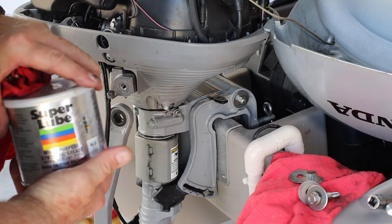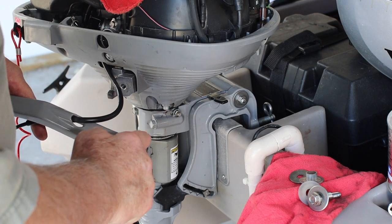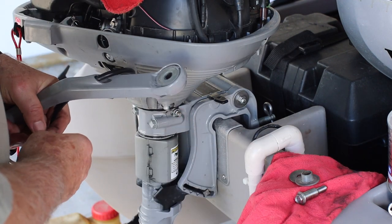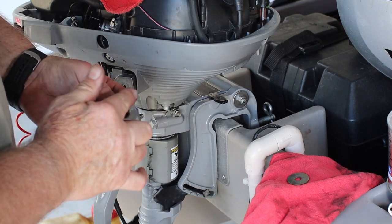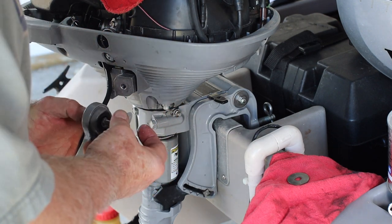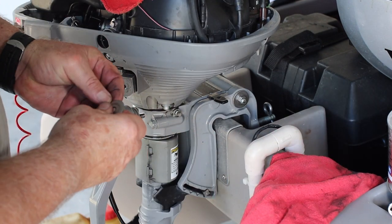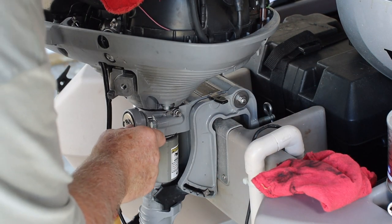Part of why I don't like using regular grease is because it's really filthy and dark colored and looks nasty. I'm going to use the Super Lube. I take a little dab and run it on the inside here all the way around, and I'm putting it on the outside surface because that's what is going to be rubbed on as this goes back and forth. I set that back in and I'm lubricating the back side of this washer. I lubricate the flat side of the washer because it's moving against that surface — this side doesn't move. That would have been a heck of a mess if I was using the other kind.